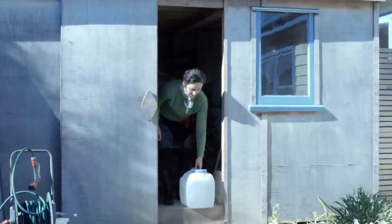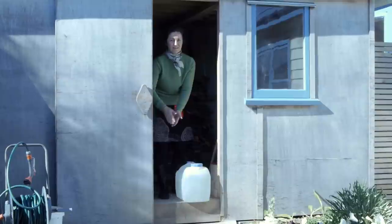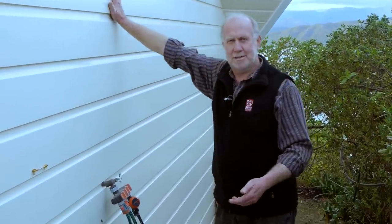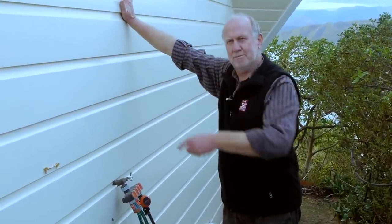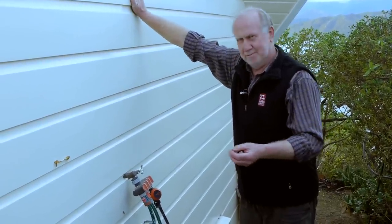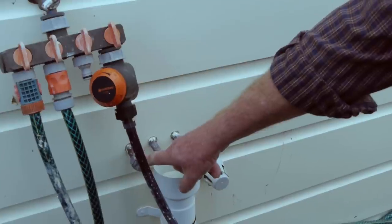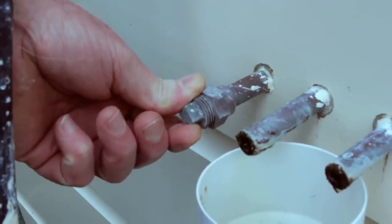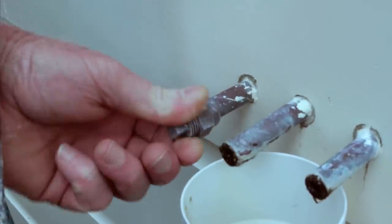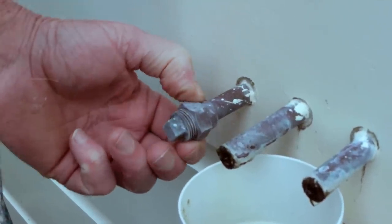This is one of the water supplies that we have — one up in the shed and another one in a shed downstairs. When you're renovating a house you often have to redo the plumbing. We put a whole new hot water system in, and behind this wall we've got a 300-litre tank. It's all strapped back for earthquakes, and we put in a little tap which drains the bottom of that tank if we lose the main supply during an earthquake.